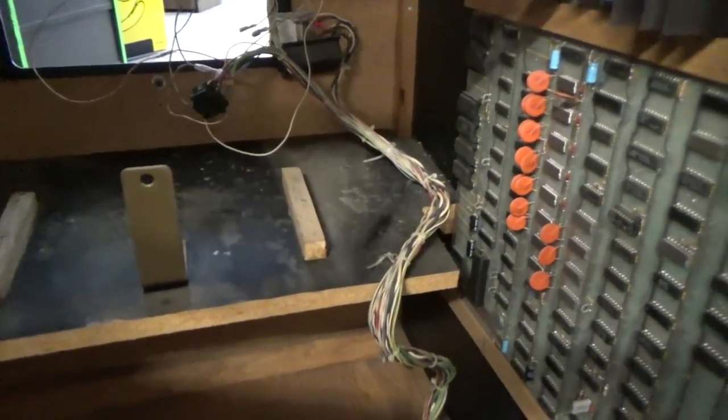So just kinda as I thought, I took that cover off of it, got back down in here. Let's see if I can get you a light. Took that cover off. Look at the back of that switch, it's all falling apart. I'm surprised it didn't blow the fuse when it did that. But that's our problem. I'm probably just going to jumper those wires for now. And that should do something. We'll see.